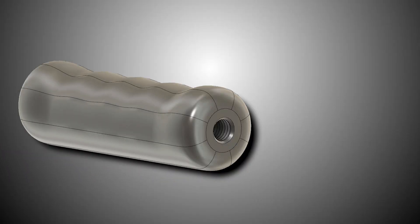Hit pause and take a look at this part. The good news is we've got this hole — that's how the shift lever will mount in the vehicle. How do we make use of that as a way of holding on to this part to do the profiling in the mill and then adding the knurling? This is what Daniel came up with.